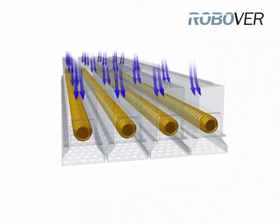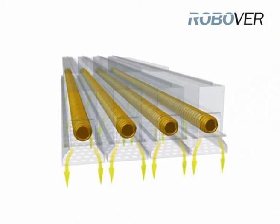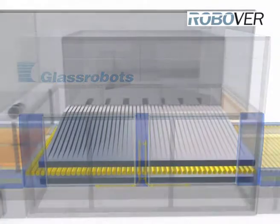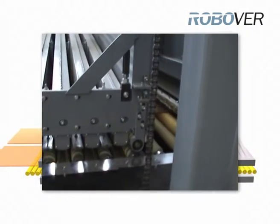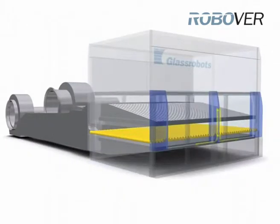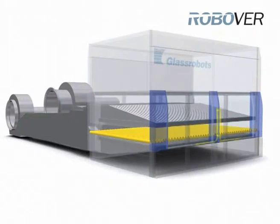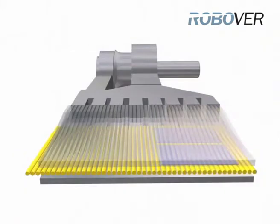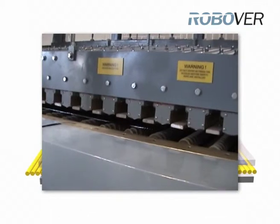The air flow in the RoboTemp is large, but the velocity is low compared to a convection system with compressed air. The chiller is equipped with sloped air channels, but with a lot of new features compared to standard quenches in the market. With an eccentric adjustment, the lower or upper nozzles can be moved closer to the glass. For different glass thicknesses, you have the possibility to have different distances from top and bottom nozzles to the glass surface, thus always maintaining excellent glass flatness.